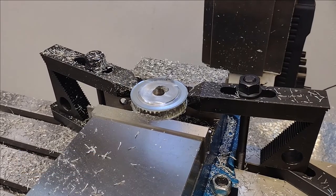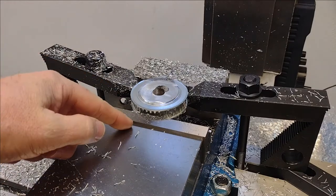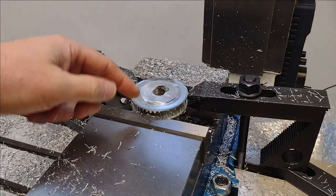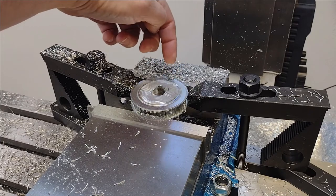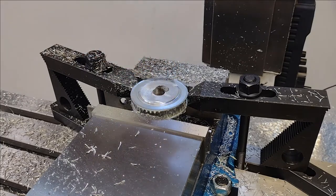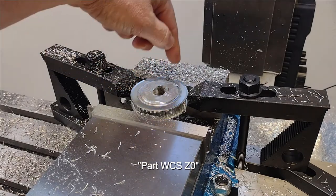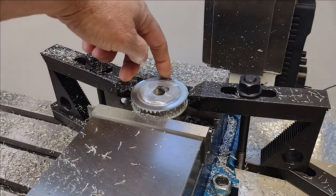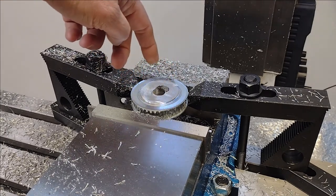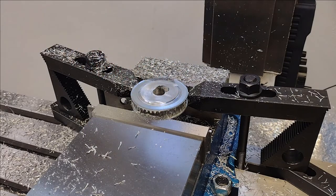There were two main ones. Well, the first one was in Fusion 360 and the post processor. When I told the system that I wanted to enter from this side of Y, and that had to do with the Z offset being off, it was coming down and trying to enter in from this side, so it dinged this up a little bit back here by crashing, because it was just trying to enter in to do the cut. So that was the first part.